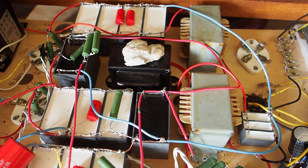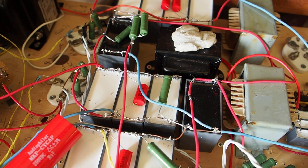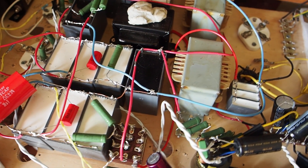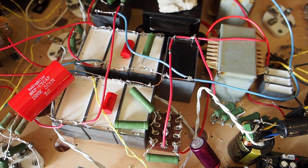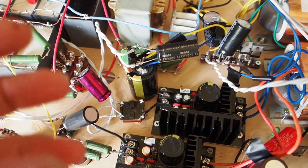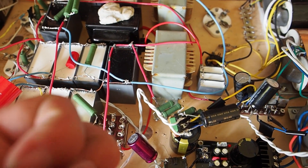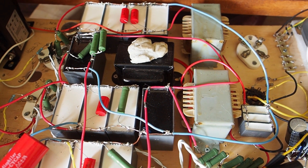The fourth aspect is isolating the power supply as much as possible for each of the three stages. Of course with three stages, things double up and it seems more complex. Hugo Bloomers made a comment about whether I went for complexity, and I'll address that. I wanted to separate the power supply as much as possible, and again — just like the DC filaments — that leads to a lot more ingredients that I need to put into the amp. It's not necessarily more complex, but it sprawls out the amp because you're addressing each individual element and not taking shortcuts or sharing things.